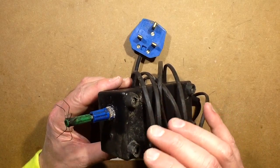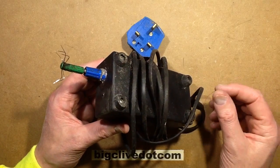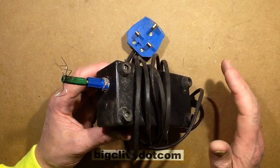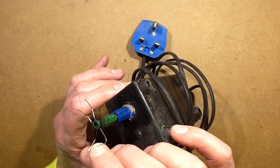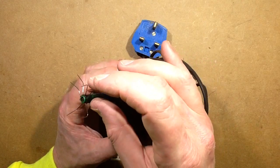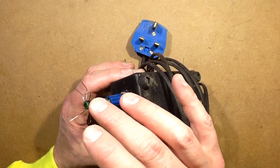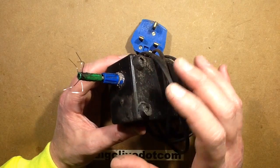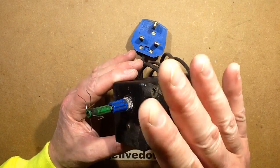The ionisers charge the air, basically, and it means that any airborne particulate like mould spores and dust and stuff like that tends to precipitate out to the walls. Well, it doesn't get rid of it, it precipitates out, but what does get rid of a lot of this stuff in the air is the fact that ionisers like this produce a tiny quantity of corona discharge on the end of the needles, and that creates a trace quantity of ozone. Not a lot of ozone, just enough to have an effect.